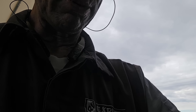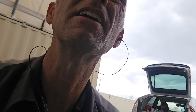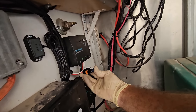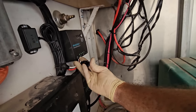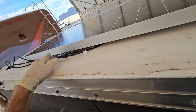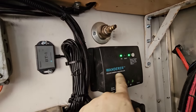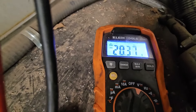I have it all wired up over here — split off of the positive lead and ground lead, taped up and secured. Time to hook up the solar panels, test the system, and seal it up. On the 100-watt system, true 100 watts at 12.6 volts is going to be about 7.5 to 8 amps, so a 15-amp fuse should be good for protection. This wire is 12-gauge and can handle up to about 30 amps. Remember: fuses only exist to protect wires from overheating and shorting out — not to protect components — because overheating wires cause fires.